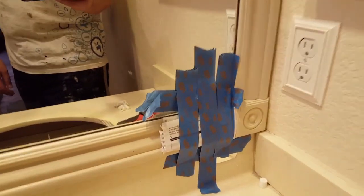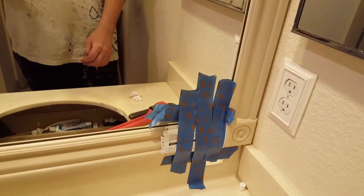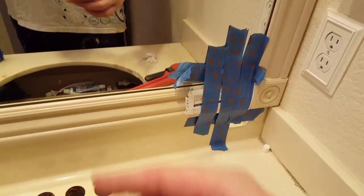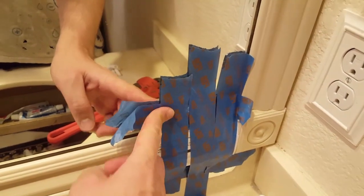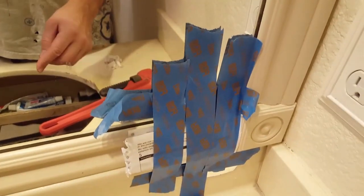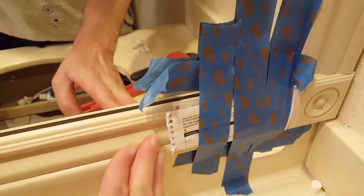Well, one more thing you might want to know, that sometimes these trims come from the store not exactly perfectly straight. So after you glue it, if it looks like a boomerang or something, it'll start pushing away from the mirror. So you're gonna have one side sticks, the other one's gonna push out and stand out. So solution, the best one that I came up with, is a lot of tape. Tape it, make sure you put more glue, because obviously over there it's gonna need it, and tape it as much as you can to make sure it doesn't lift away, and let it dry that way.